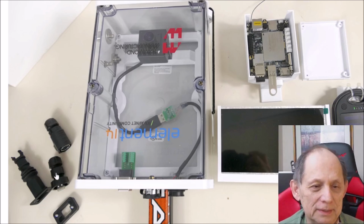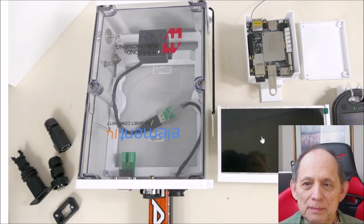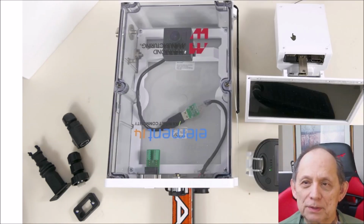And there's all kinds of gaskets inside here, and you can solder the cable to a little card, which is at the other end of this USB connector. The circular connector has a similar ferrule up here, which can be tightened down onto a cable. And it's a very rugged latching type connector. You can just bayonet this thing on, and it will maintain a watertight seal. So next picture. This one just shows the Latte Panda assembled with the display plugged onto the top of it.